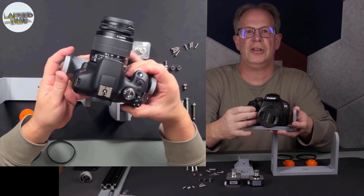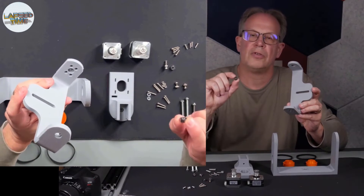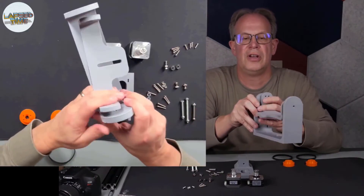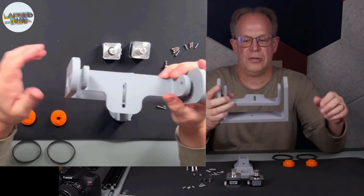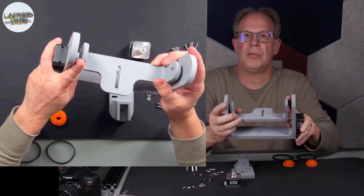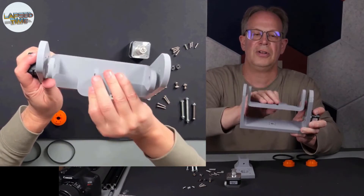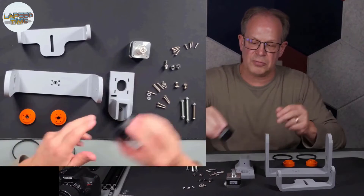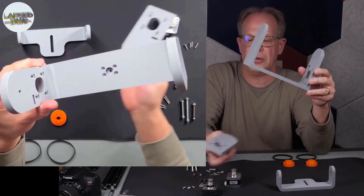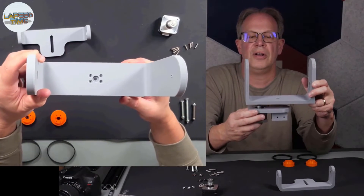The camera would sit on here and it also has room on the side for some roller bearings - this will be the main mount. So this is going to go onto here, we'll have a stepper motor onto the side, a gear up top, and the camera sits on here. This will be the tilt, and then the whole thing will rotate. The last piece will go underneath, and I'll have my other motor onto here which will give me my rotation.